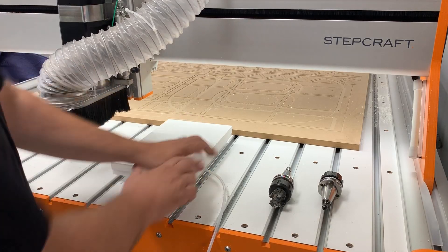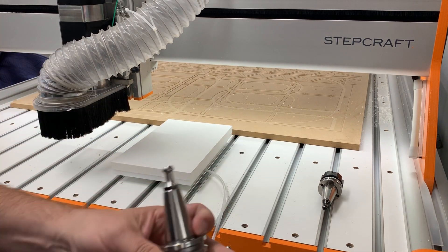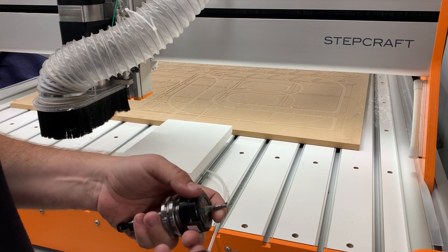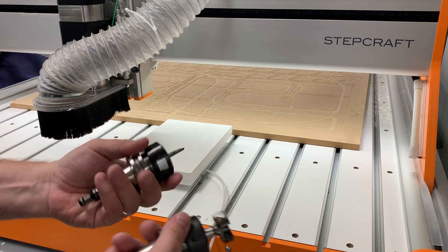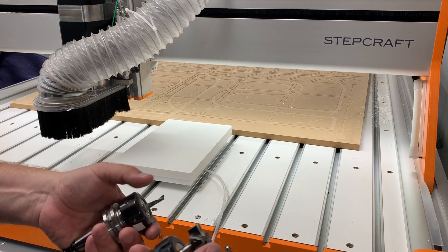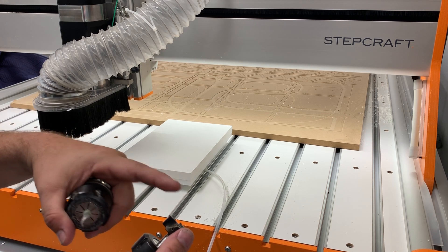Push down to make sure that's secure. Now the first tool I'm going to touch off is the surfacing tool, and then I have a quarter inch up cut plastic cutting bit. The XY zero is going to be the same for both of these, but the stick out is going to be different from each of the tool holders. We're going to use G55 for the surfacing bit and touch off Z and record that.